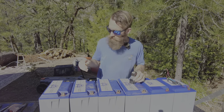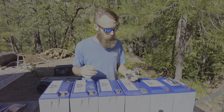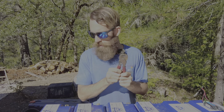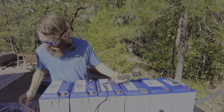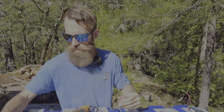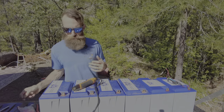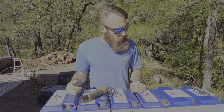I've got my handy dandy wire crimper — you use it with a sledgehammer. You take these little battery terminal connectors, put them in here with the wire, and slam it with the hammer and it crimps down. Those crimps have been holding just fine. There are expensive hydraulic crimpers that do an octagon shape, but this does a triangular shape and it's good enough. We also have cable cutters, which are important for a big project like this, and a heat gun. The heat shrink material slips over the end of your cable with the crimped connector and when you apply heat it shrinks around it, protecting the connection from corrosion and arcing.